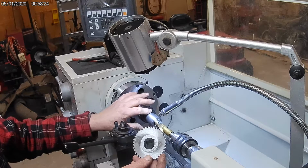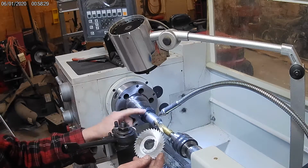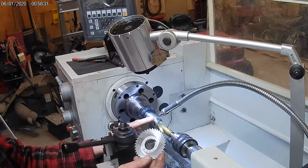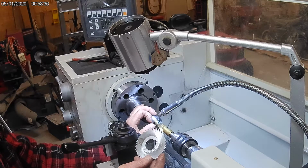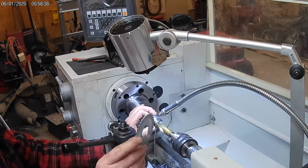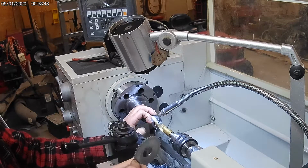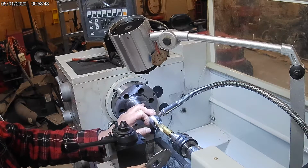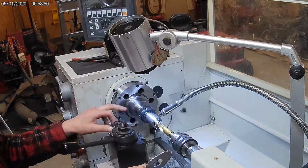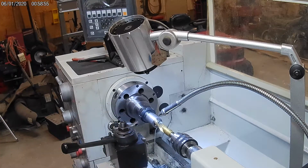And then I'll drill a small hole up the middle and I'll thread up in here, and the bolt will go up and just tighten up on there, and that'll allow me to fit. I'm going to have about a 1/2 inch of range in there, so it'll go all the way down to fully closed, which will let me run the real thin ones. And I can go up to a 1/2 inch, which I'll probably never go close to that. I think the most I'll go is about a 1/4 inch, but I figure I'll make it with the extra capacity, just in case.